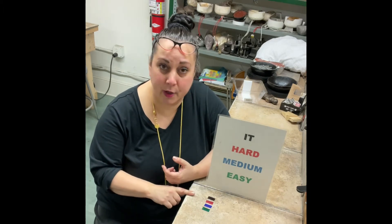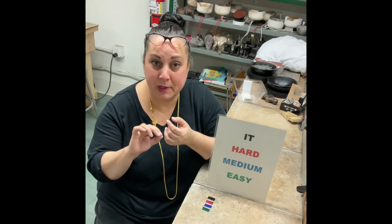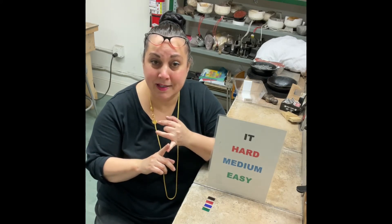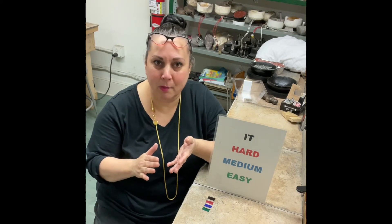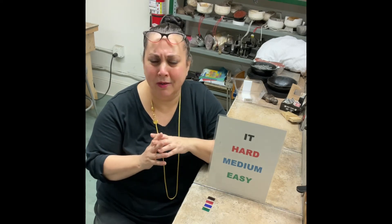The reason we like sheet solder is that it comes in a couple of forms: sheet, wire, and paste with little bits of solder in it. I do not like paste solder at all — it's a tremendous mess because you have flux and a whole bunch of tiny little bits of solder, so every place you put it has solder. Unless you're doing something like filigree where smearing it across works great, in most other scenarios I do not want solder everywhere. So I pretty much never use paste solder, except in very rare occasions.